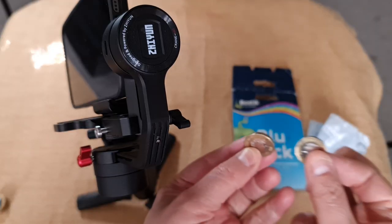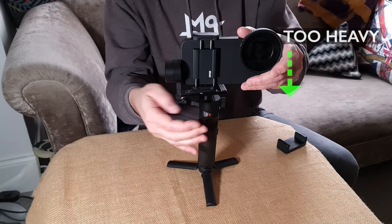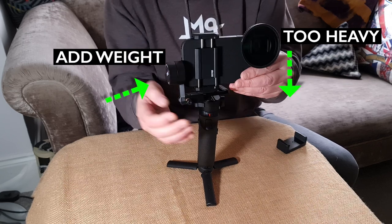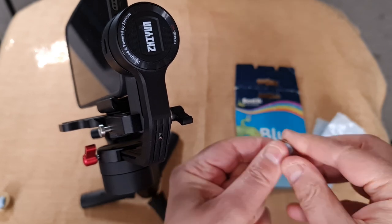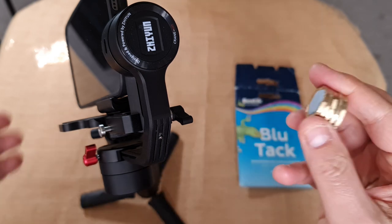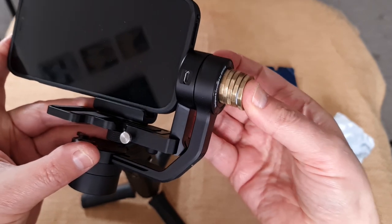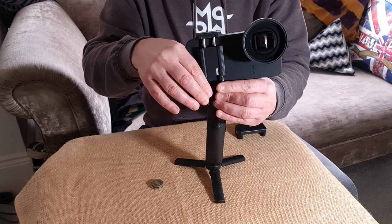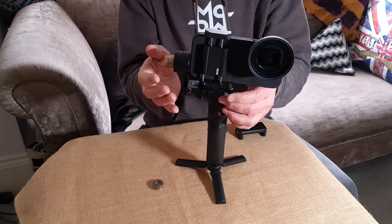This is my patented counterbalance method — the royalty is about 5 quid, because you'll need some coins and some Blu-Tac, or whatever it's called in your country. To counter the extra weight on one side, we need to add weight on the other side. Unfortunately the Zhiyun Crane M2 does not have a place to add counterweights like the Osmo Mobile gimbals, so we need to improvise. Use the heaviest coins you can find, or something else like heavy washers. Each coin is stuck to the next with a pinch of Blu-Tac, then the stack of coins is stuck to the outside of the tilt motor with another pinch of Blu-Tac. Just keep adding coins until the smartphone is more or less balanced. The downside of this method is it doesn't look pretty and the coins are prone to fall off unexpectedly. Some people add counterweights using a Velcro strap, which is probably more stable and nicer looking.